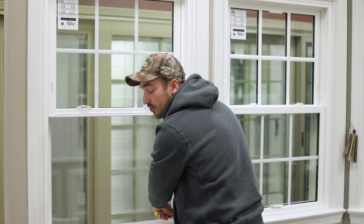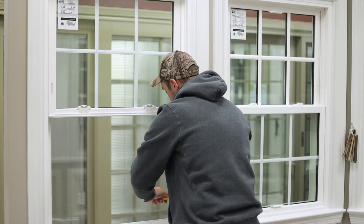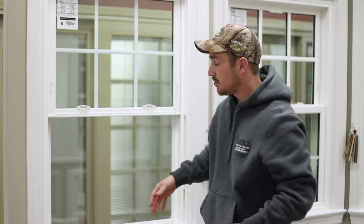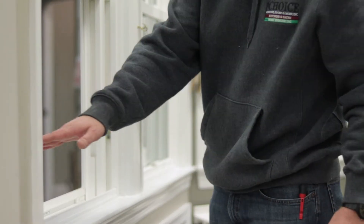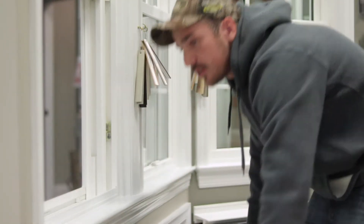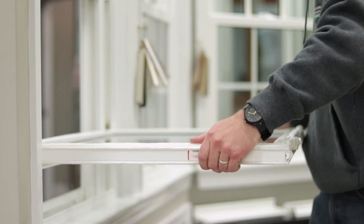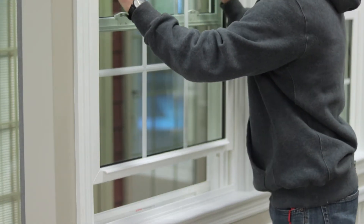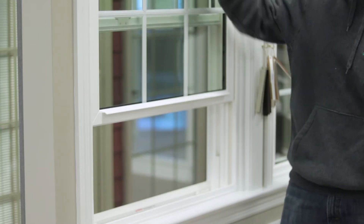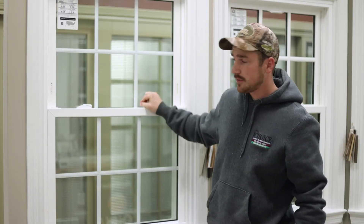You need to be ready when you rotate it clockwise because there's pressure upwards. If you don't hold your screwdriver fast, it will go up way too quickly, so let it come up slowly. Once you have your shoes on the same plane, it's going to be ready to put your sash in. Make sure your sash is 90 degrees from the frame, and it will stay in. That is how to put the window back in the track.